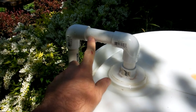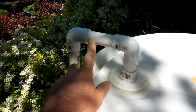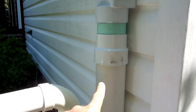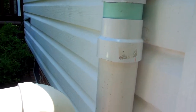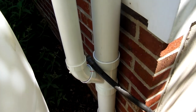Depending on how much rain we get coming into this thing, only time will tell. As soon as we get a good heavy rain and this thing fills up I'll be able to do some analysis. If not, what I thought I might do is put one of these Y adapters up near the top, except inverted, so if the pipe is full and the drain can't handle it, it'll basically overflow out the side and you can route the pipe to a safe location.